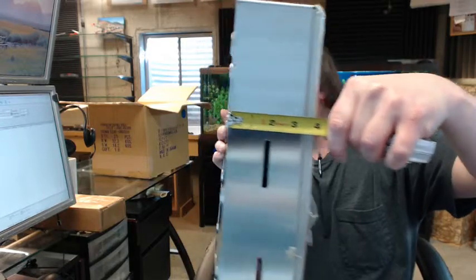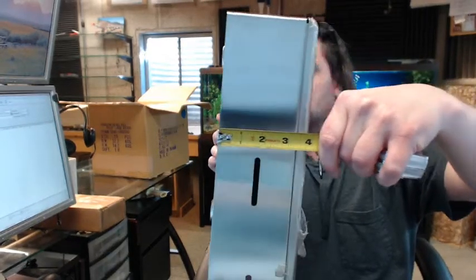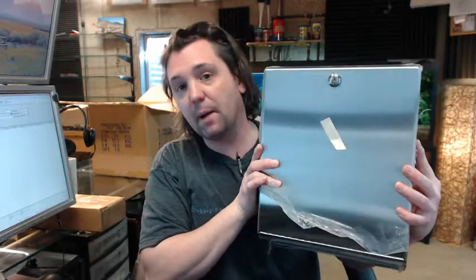Projection comes in at 3 and 7/8 inches; the spec lists 3 and 15/16 inches, so we are right on. A very important item on the product specification is the recommended mounting height in the upper right-hand corner — there is a mounting height for both standard and handicap compliant installation. Recommended mounting height off the floor to the top of the unit for ADA compliance is 54 inches. Be sure you are installing these at the proper height based on your application.